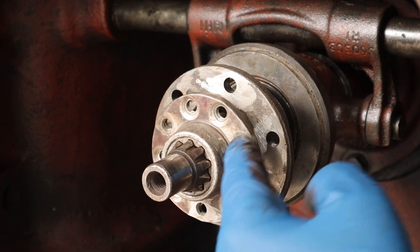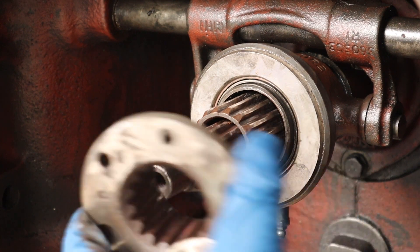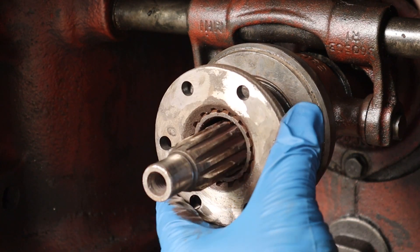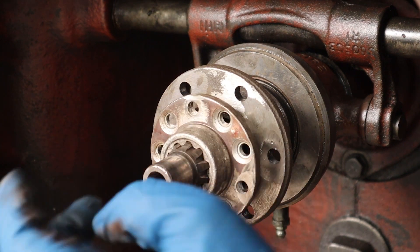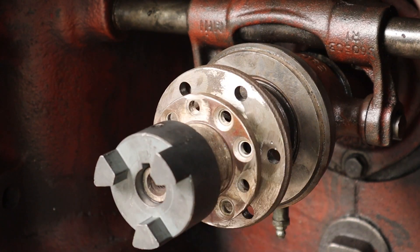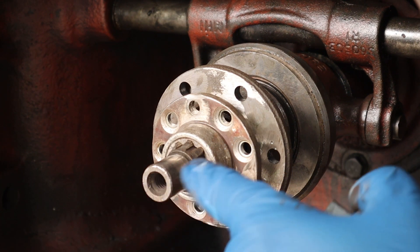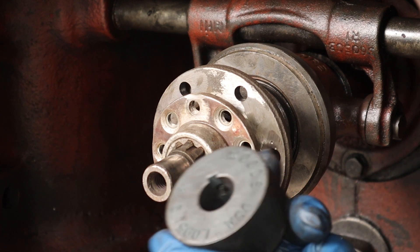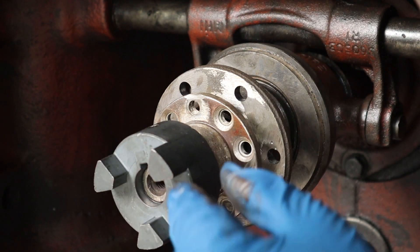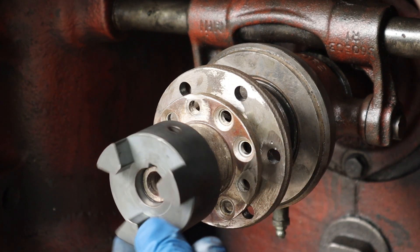In this case we're going to couple them together just to make things a whole lot simpler mechanically. If I slide this all the way back, it doesn't even hit here because of that step — the difference in diameter between the two of these. So I'll put it all the way on and pull it back just a hair. Then we've got our Lovejoy coupler — notice it doesn't go all the way on because it's hitting where we've got that transition from a smaller size to a larger size plus the spline. So maybe put this on a lathe, take off a bit of material on an angle, just to bring the tip of the input shaft up even with the jaw coupler.